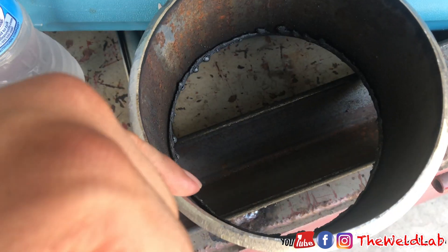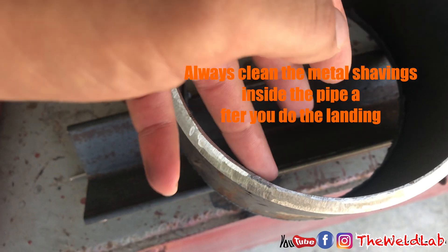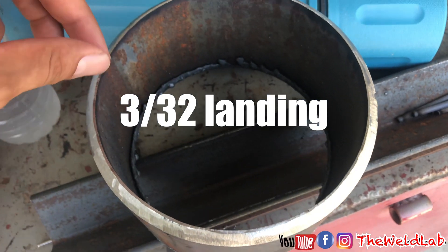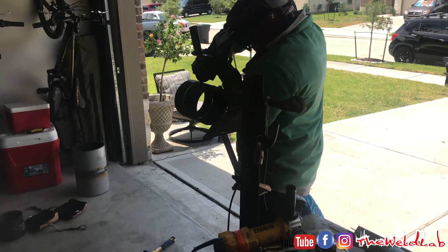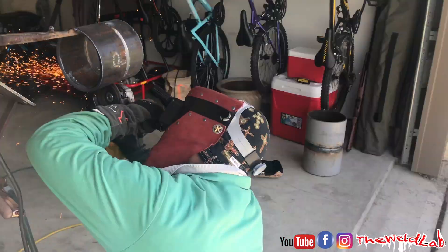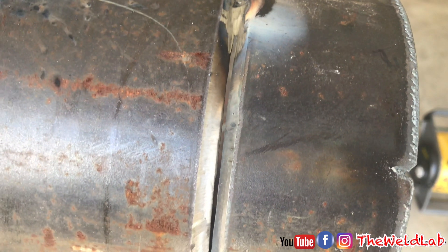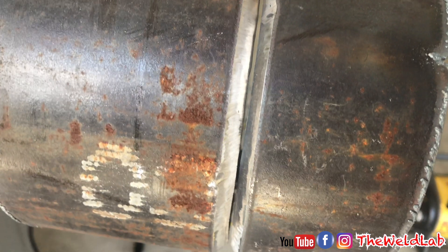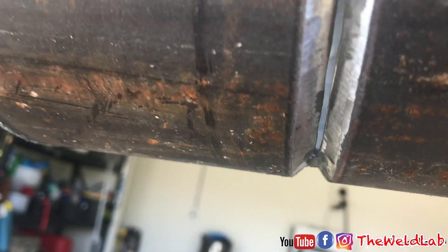One good tip is to always clean the inside. When you put your pipe in, it means you need to clean the inside and take all that old metal off whenever you do the landing. I like a 3/32 landing on here, and this is gonna be our spacer — a saw blade — and that's all you really need. Once you tack it up, this is what you want your coupon to look like: nice feather edge and a nice even gap all the way around. I personally like to use a saw blade for anything six inch and smaller, and for eight inch I prefer a 3/32 gap.